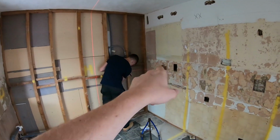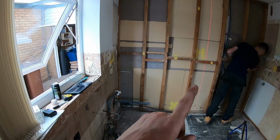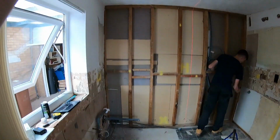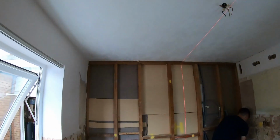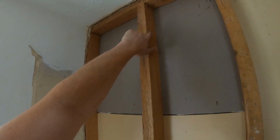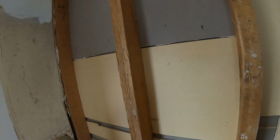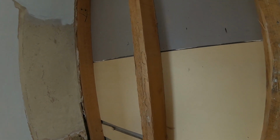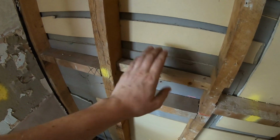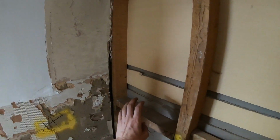That one over there is fine. That socket's fine. So I'm going to do that. I'm going to draw a permanent line across there. That's done. I'm going to go and drill the 6mm down. There was already a socket cable there, so I'll just maybe drop that down the same and do it like I did the other job. Clip it to the inside, bring it out within 100, greater than 50mm. Got there in the end for here, and then we'll start on the ring main in here, probably.